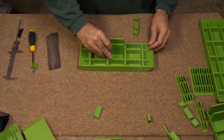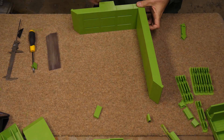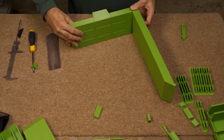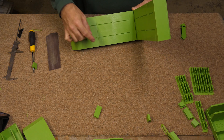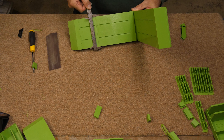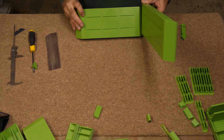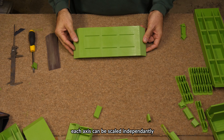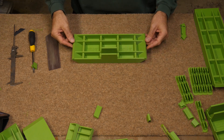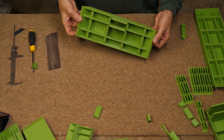If I can get the concept and the casting correct, then the overall shape and sizes of the parts can be redone in any size. I would really love to know what depth of drag and cope you guys like best. For me it's probably 75mm for the drag and cope depth, but for some of you that might be too deep — and obviously the deeper you go, the more sand you require. It might be nice to start small and go big later, just to save on printing times during design and testing phases. These patterns are actually quite big — I based it on a 75mm width to the parts and a sand depth of 120mm, which in retrospect might have been too deep. The basic shape of these parts with four ribs might not be optimal; perhaps three or five would be better. I think casting them will tell a lot about the design and what needs redoing.